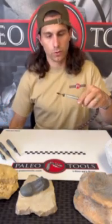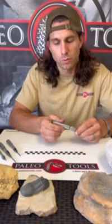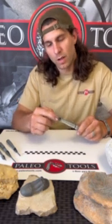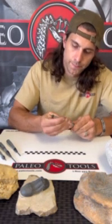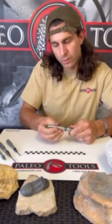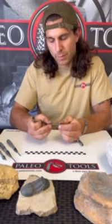So I just want to go ahead and go through kind of like the basic use of this tool. We just send it with a little rubber cap. You can take that off. When you're going ahead and using this, if the stylus wears down, the way to remove that is to go ahead and take off the front end, which is this part right here. The bushing doesn't come off, it's been pressed in. So you just unscrew this. And the threads are only on here on the bottom end, so after a few turns, you just give it a light pull, and it should just come right apart, like so.